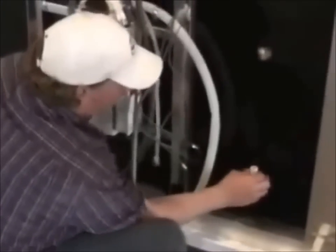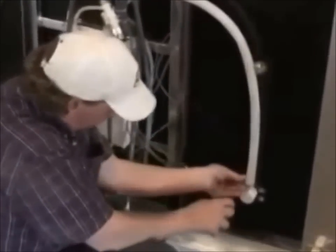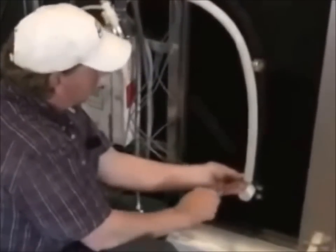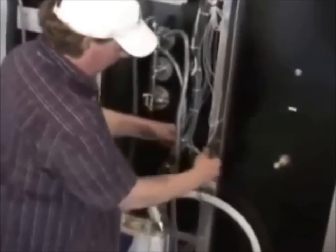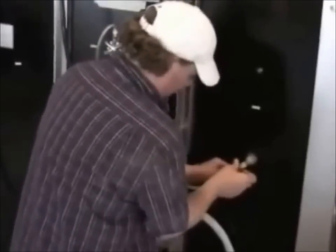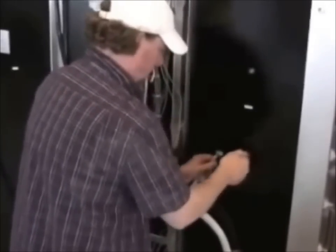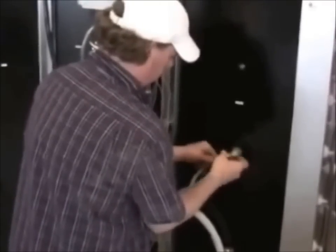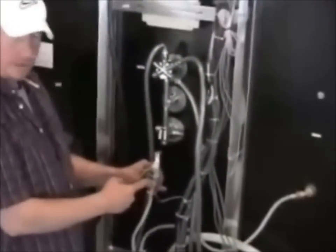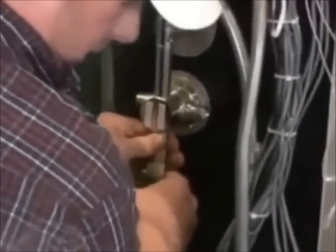Move over to your steam outlet — make sure that fitting is tight. It comes with a hose connection, so put that on and tighten it up. Next, working on the steam generator, you've got a little white gasket that comes with it — it'll be zip tied to the line. This is for your cleaning outlet and your aroma. Make sure it's a tight tube — it's got a good gasket in there. Over here is your water inlet with a solenoid going into the steam generator — it has a gasket already in there, so slip that up.